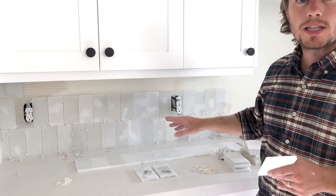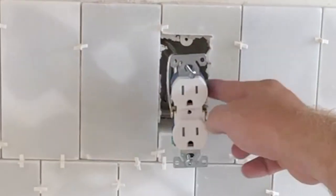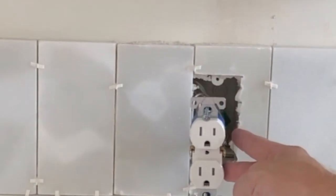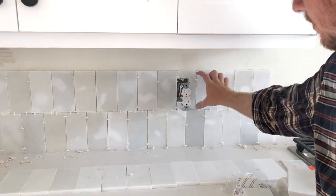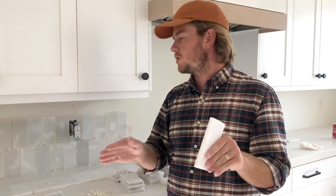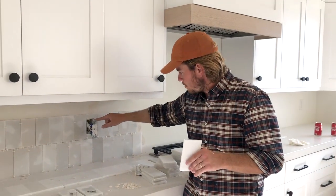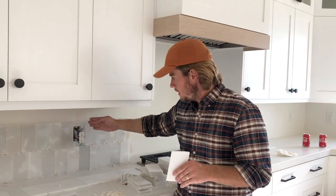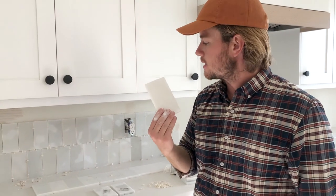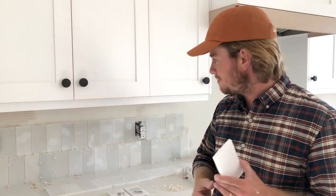Probably the most challenging thing to take care of is getting these 90-degree cuts inside corners. They're not super clean, but honestly you don't need to worry about that because that's going to be covered by the outlet cover. You cut down the two widest angles and then cut a couple more lines like a comb, then take it diagonally to get down to the point you want. This is extremely fragile stone so I've had to really take my time on those and it slowed me down quite a bit.